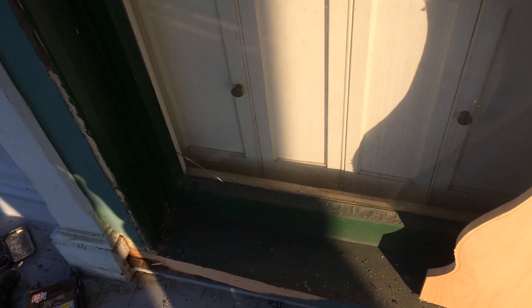We're working on this window — it was not square. The window glass was square but the frame was not square anymore. We could tell because on this side there was a half-inch gap. The other way we could tell is when we put the top window up all the way, they still didn't meet — they were about a half-inch off. You can see someone at one point tried to fix it by putting a shim in.